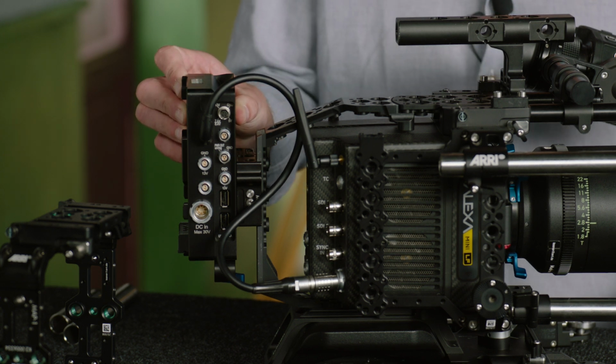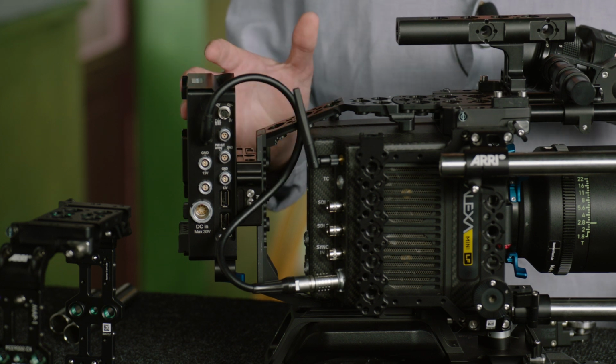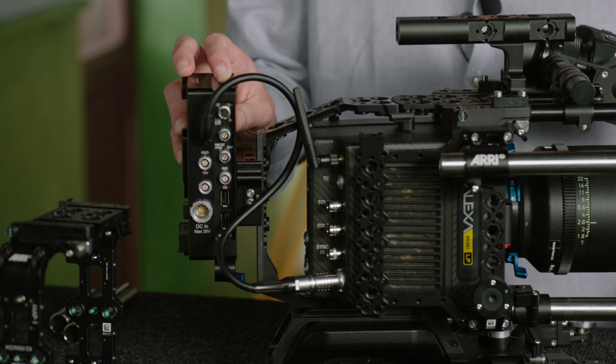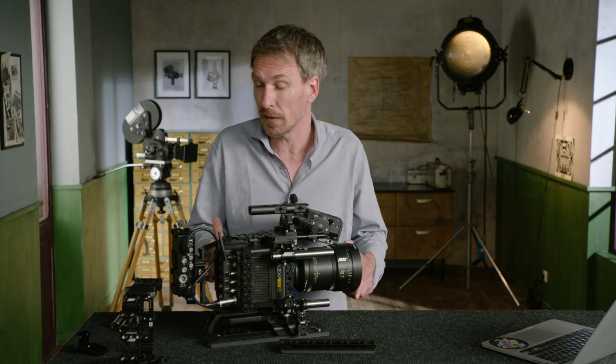And the response was, please allow more than 4 centimeters. At ARRI, my engineer colleagues are extremely careful and conservative, and they test everything. I think the camera stayed in a climatic chamber at 45 degrees for an entire weekend, just to prove that this distance would be enough. This is why we stuck with a large distance, as opposed to a very, very short distance between the accessory and the exhaust of warm air.